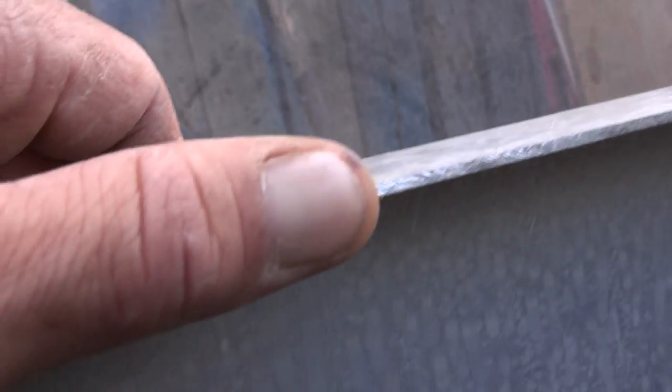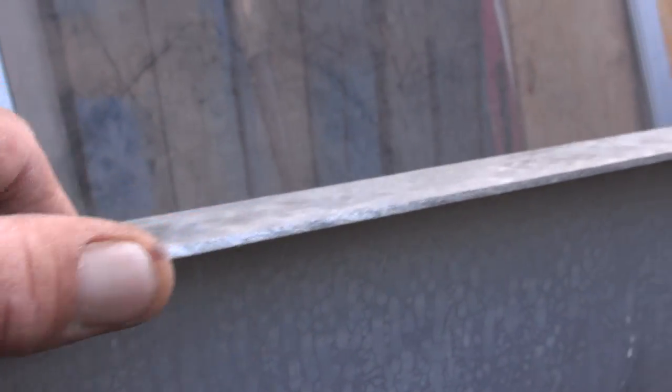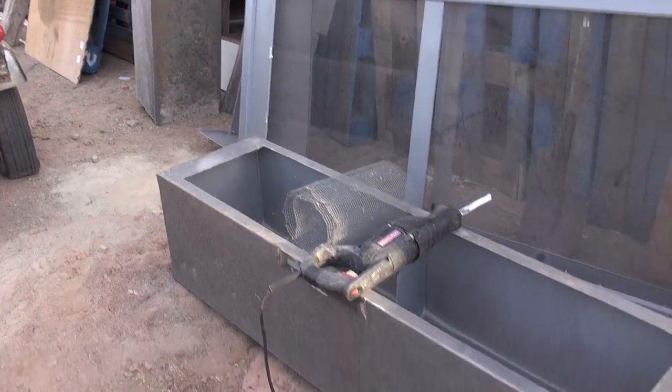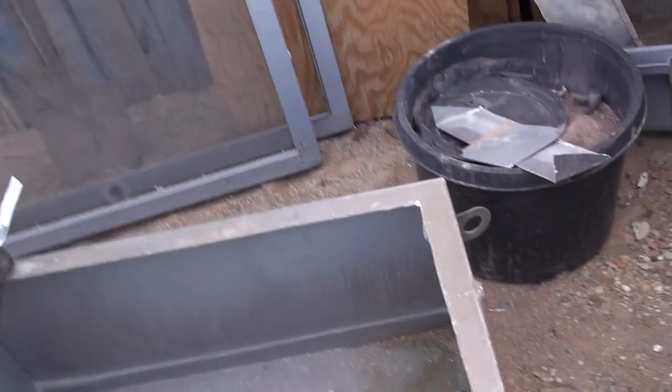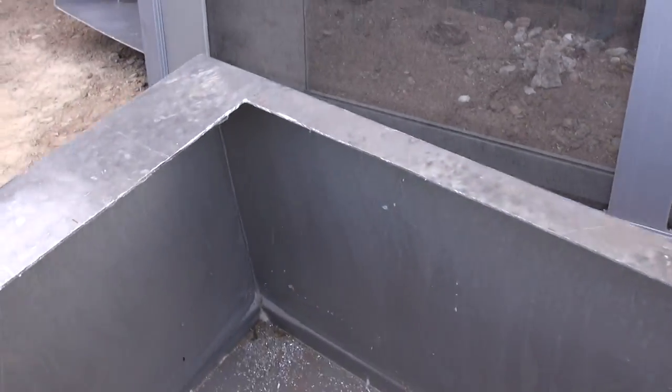The wonderful thing is this is pretty thick gauge aluminum — you can see compared to my thumb, and I have kind of a fat thumb. So it was easy to cut with a skill saw with a carbide tip blade. It just mowed right through like butter and makes a nice straight line for a ridge that the sled is going to sit on.